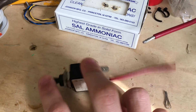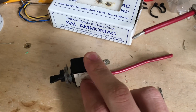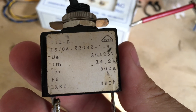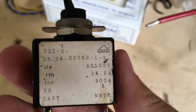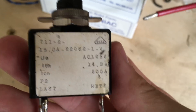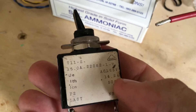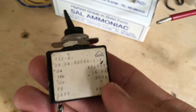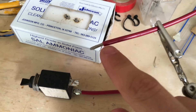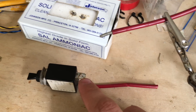The next step is I went ahead and added some thick gauge wire to a switch. I'm going to attempt to use the switch to turn on and off the capacitor bank — basically push the switch down to discharge the capacitor bank into the load. But I'm not sure if the switch can handle enough amps. If we look on it, it says ICN which is 500 amps, but ITH is rated at 14.2 amps, and there's 15A here as well. So we'll see which one it is when we try it out. I'm going to solder the remaining lead to this tab and then screw it into the terminal strip.